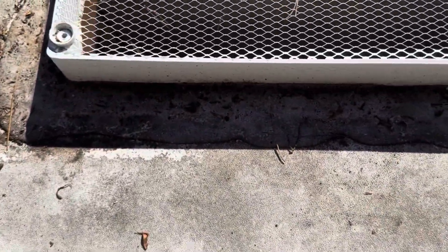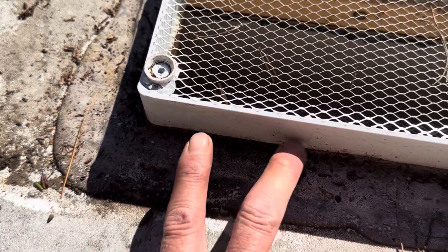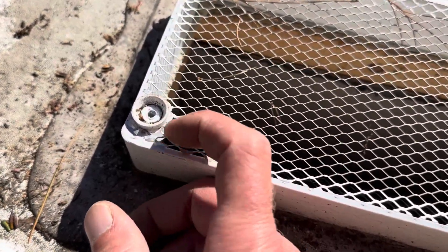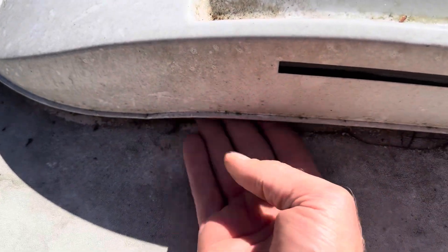That's a good spot — you could drill right here if you wanted, or you could put a flange, a couple of connectors, your choice. You could just knock out a little spot right here, run your PV cable down, staple it to the sides down in there. Or you could even mount a little weather-type box and seal it to the roof. Probably just going to make a little notch right here and run my PV cables down through there. It's kind of bright but it's open, so that's the easy way — PV cable in right here, throw your cover back on. It's got a nice little finger whip-gap seal so you can take your cable in and down. It'll save you so much time — no wire molds or conduits needed. Let me show you the view from down in the actual cavity of the refrigerator.